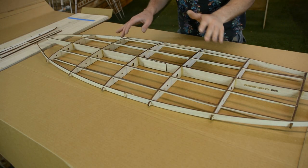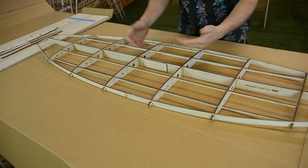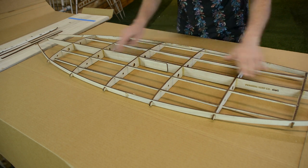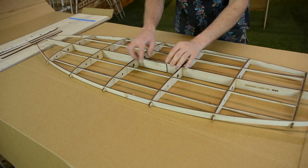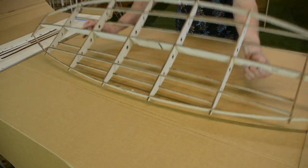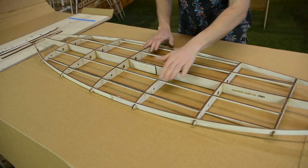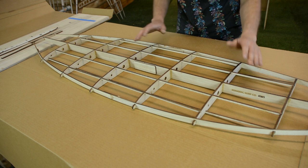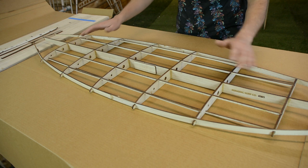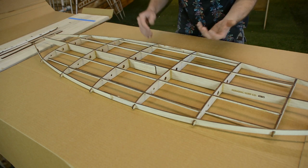These new frames have a lot of added bonuses as well. Not only do we have the thicker material, but we're getting away with using less material overall, because instead of having three spines we're using a single spine — the stringer — with our ribs, plus reinforcements placed all over the frame to help increase rigidity and stiffness. All of this extra material over the frame also increases the glue area when applying our decks, which is going to create a much stronger lamination and deliver a more reliable and consistent result.